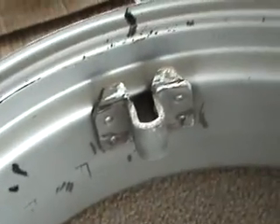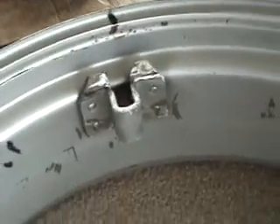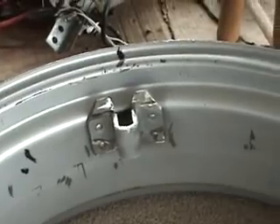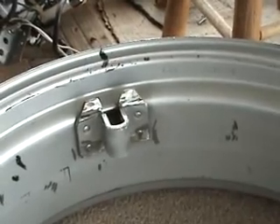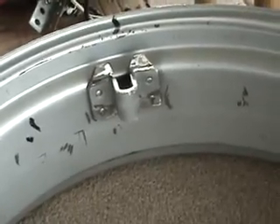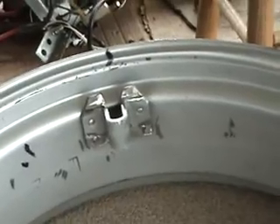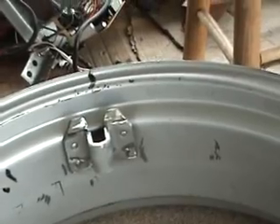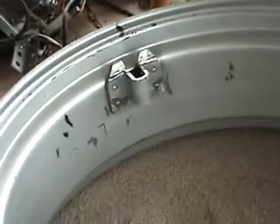Of the four positions for placing that cast iron wheel from my 1939 Allis-Chalmers B, two positions will have the bolts on the outside, making tire servicing easy. The other two positions place the wheel inside the cast iron rim, meaning you'd have to remove the cast iron wheel from the tractor to service the tire. On my tractor I'll probably choose bolts on the outside for easier service.